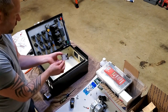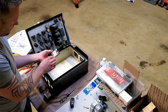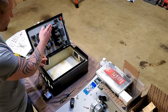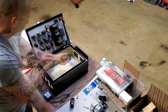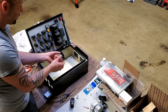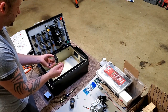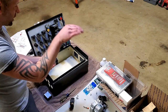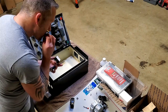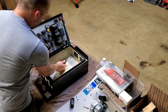So looking at this SSR, you have the output side and the DC in that triggers it. Even though the DC is actually coming from this side, my relays for my AC are going to be on this side, which are going to be much thicker cables, so I think I'm going to put my AC routing to the left. And then the DC, I'd have to come in and swing around and go in, but I don't think that's going to be that much of an issue, so I'm not getting this all over.